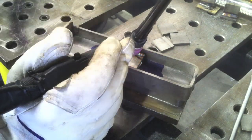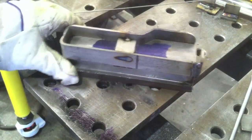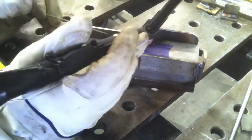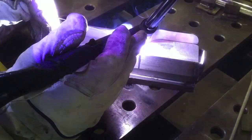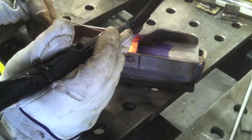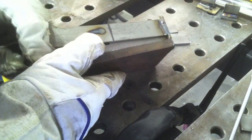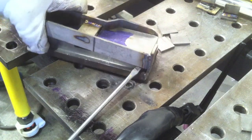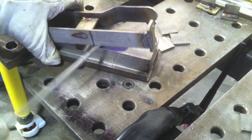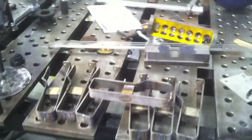The big number 12 cup helps a lot with keeping discoloration to an acceptable level — keeping a little luster to the weld instead of turning it all gray, which is a big problem with stainless. I actually have to use a little scotch-brite diffuser — cutting a small disc of scotch-brite — which provides really good diffusion. You can also use a stainless mesh screen as a diffuser, but it needs one or it won't work at all. It's set up to use with a gas lens, but needs an additional diffuser besides the gas lens. You can see what kind of time I'm having prying this thing off the fixture, and it was only partway on — so welding it out fully on there would have been bad news. Seven of them all done.